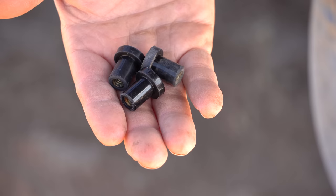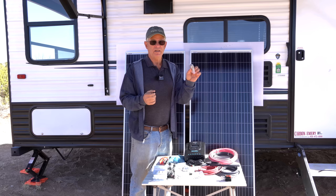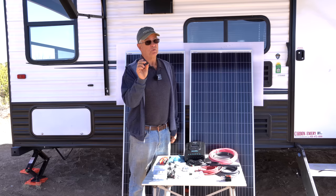And these are called well nuts. And I have used these with great success on solar installs. Instead of trying to screw the solar panels to the roof with the hardware they provide, which creates a lot of unsealed holes that you have to seal up, we're going to use these. They're rubber, and as you tighten them, they collapse like a rivet. So not only do they hold very well on the very thin roofs on RVs nowadays,